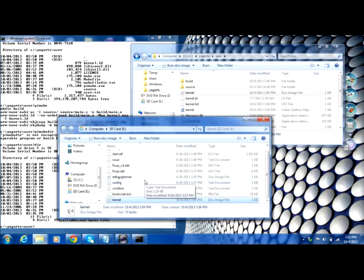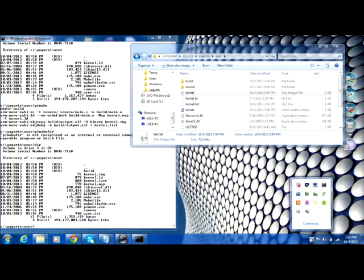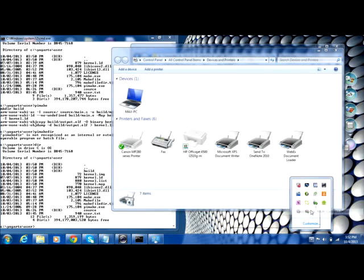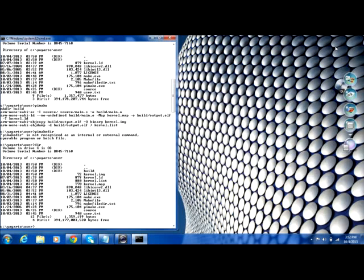You can see that another kernel file is given to us, but it doesn't actually run the code that we just talked about. So we just gave it a nonsense name so that it wouldn't be used by the Raspberry Pi while booting. Now that that's done, we will eject our SD card and put it into our Raspberry Pi, and then we can show that it's blinking, and lesson 2 will be complete.